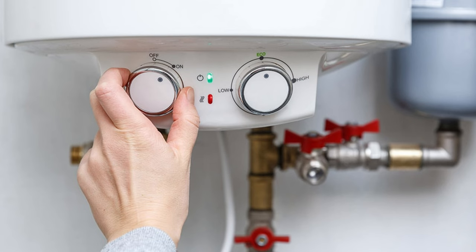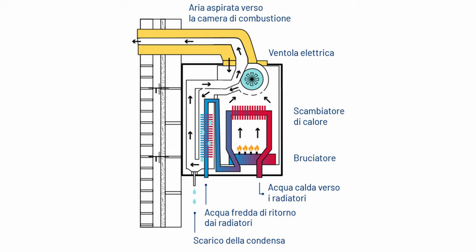How much to turn on the boiler? There are different types of boilers, but as far as I know — of course, in Italy when I wrote this article — the only one that complies with the law is the condensing one. It's a type of boiler that uses the same fumes produced by combustion to enhance the heating of the water, which will then flow in the system. However, this advantage will be greater with the boiler still running. It will be lost with a frequent on-off. Therefore, it's advisable to keep the temperature of the water below 50 degrees Celsius.